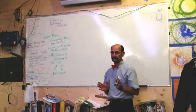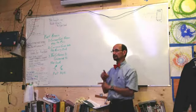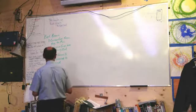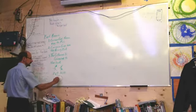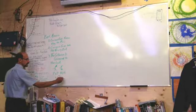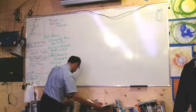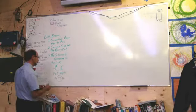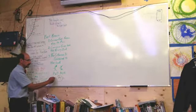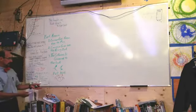The characteristics of those motors are they need DC, and you can make them go either way depending upon the polarity you put into them. The symbol I'm going to use for a motor is just a circle with an M in it, two leads coming out, one saying positive and the other saying negative. The polarity I've got will determine the direction. So if I have positive on one side and negative on the other, it will go clockwise.